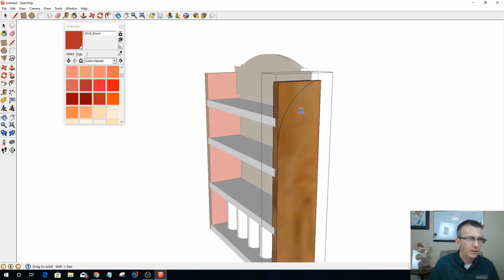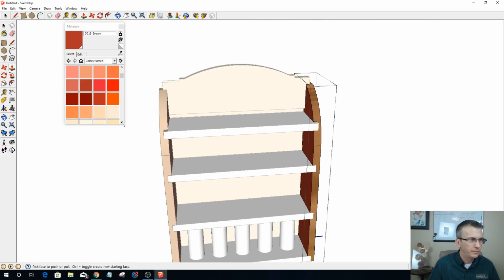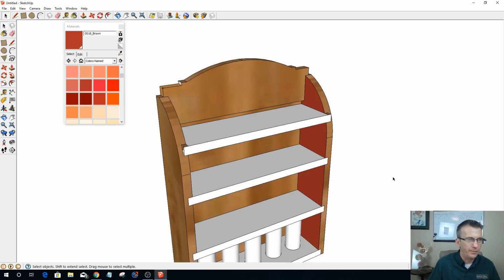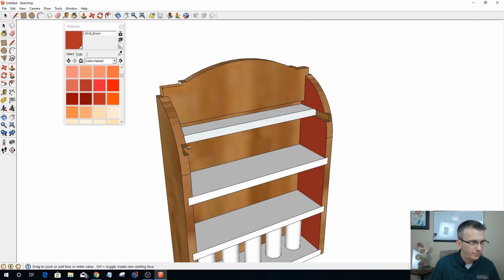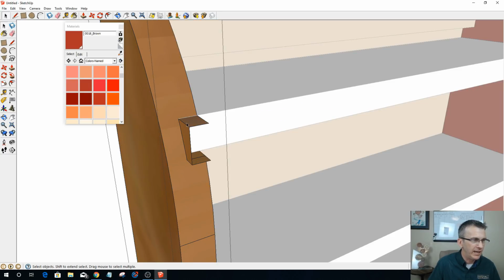Yeah, why not? I might decide to do something a little bit different when I get to the Vectric, but let's take and get rid of that and get rid of that. And then I got to come in here and push-pull this. Oops. Stop. I want to pull that back to there. And what that will do is that will now allow me to come in here and delete these areas here and these lines. I don't want these extra lines coming into the Vectric software and everything.